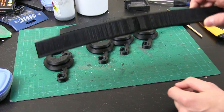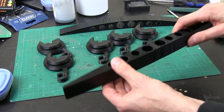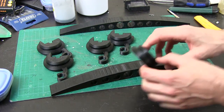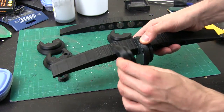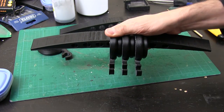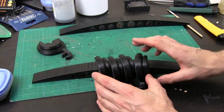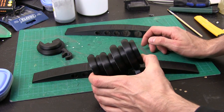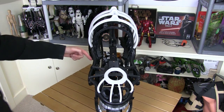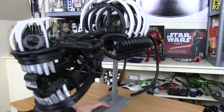What I was printing there was these things in two halves — I've acetone welded the pieces together, basically melting the plastic with acetone and squishing them together to make a chemical weld. I've got these rather nice curve-shaped things which are curved in two directions, and we're going to align the stacked sections along them. These are just going to be acetone welded on and aligned, and then we can feed conduit through the bottom there to make the bottom feature of the head. All of these will go together to make a really long hose-looking thing — I've got left and right versions which are symmetrical.